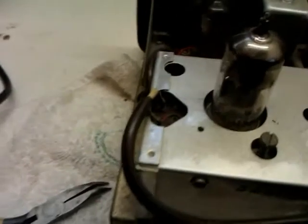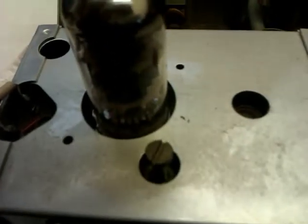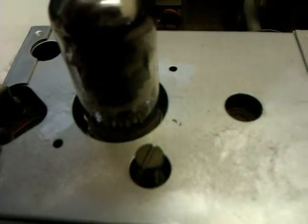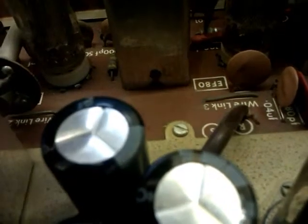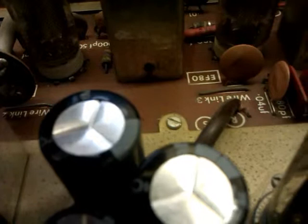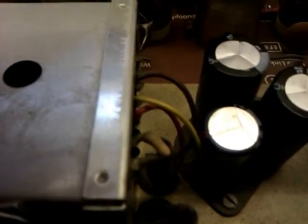I'm just going over everything. I like to. Ooh, hang on a minute. That capacitor's got a hole in it. I don't like that. I don't like that capacitor there, ladies and gentlemen. This one here. I'll have to test him. What value is he? He's a 300 nF. Or is he a 300? Oh, 300 picofarad he is. No, he's not. He's 100 picofarad.